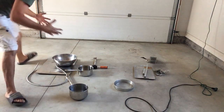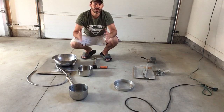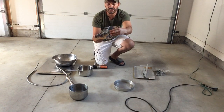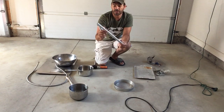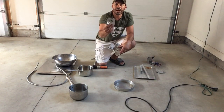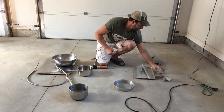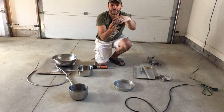The last test is the knowledge test — knowing where certain materials come from, which comes with practice. For aluminum, you're going to find aluminum heat sinks off of circuit boards, lightweight aluminum in wet mops and appliances like Swiffer Wet Jets, aluminum transformers out of microwaves, and nice fans with a frosty color that are not magnetic and are light. A lot of motors also have these really nice circular aluminum plates that are very light.